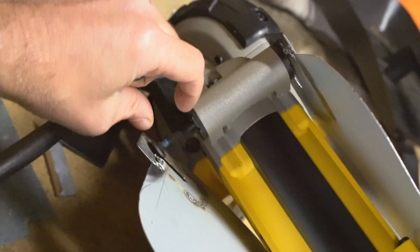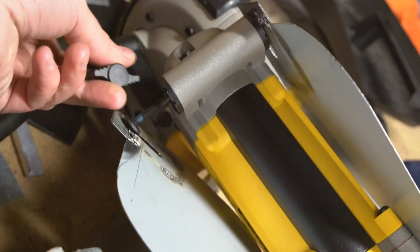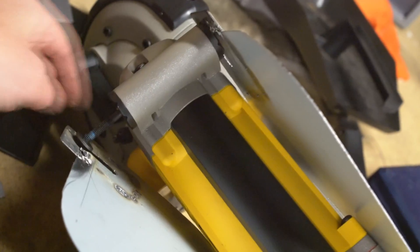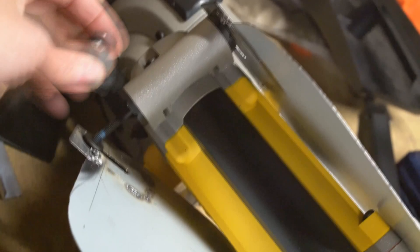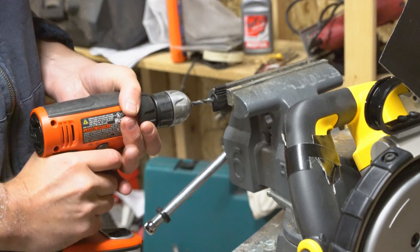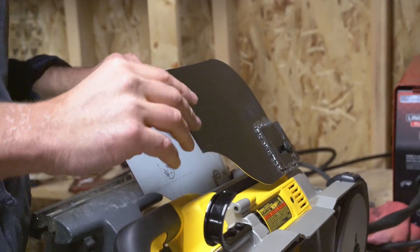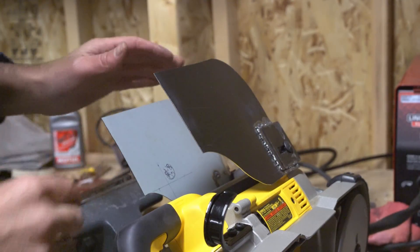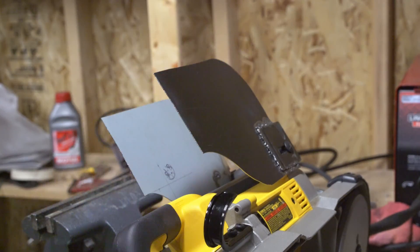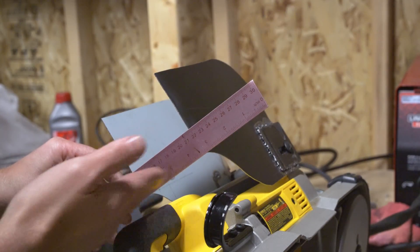So we've got an extra 40mm length now — that's two sides of the handle. And because the cap is closed on the end it gets so far and it's going to stop, so I'm just going to drill the end out. I've got this jigged up in there now, it's come tight and it's really nice. This is basically just how it's going to be positioned. The end of the table is going to be here — you can see the edge and there's going to be plenty of clearance.